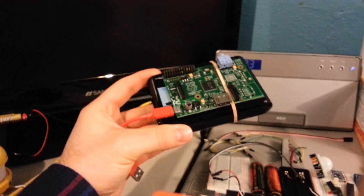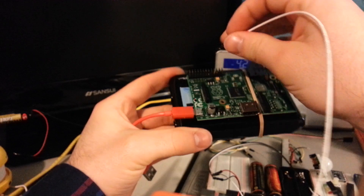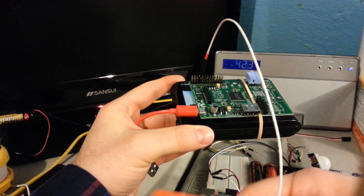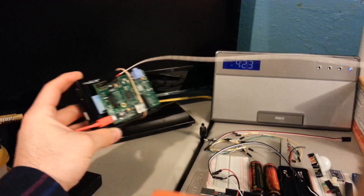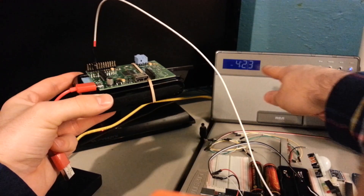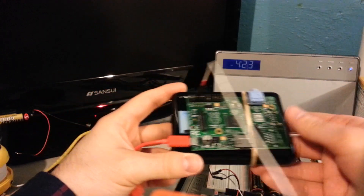Really simply, all you've got to do per Pi FM is just get an antenna. I use GPIO4, like in the examples — easy pin to remember. This is just about a 16-inch antenna, nothing major. The radio is right here, so we probably don't even need it to really show for this example.